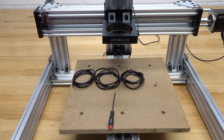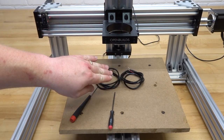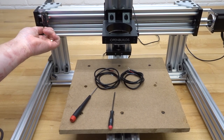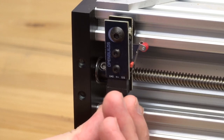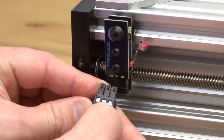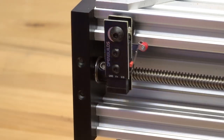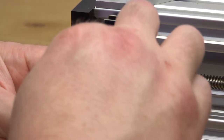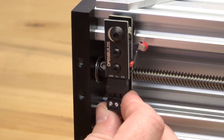Taking the two-conductor wire — red is positive, black is negative. With the pins facing upright, red goes to the right and black to the left. Tighten down those pins and reattach to the LED light ring, throwing the wire towards the back. Next, take one of the three-conductor three-foot cables and attach it to one of the micro limit switches. These are consistent in size, so it doesn't matter which goes where as long as each micro limit switch receives a three-conductor wire. Starting with the X axis, detach the male connector. On the micro limit switch you'll see indications for ground, positive, and signal. With the pins facing upright: ground to the left, positive (red) in the center, and blue to the right for signal. Loosen each pin, insert — black to the left, red in the center, blue to the right — then tighten down each pin and reattach to the micro limit switch.